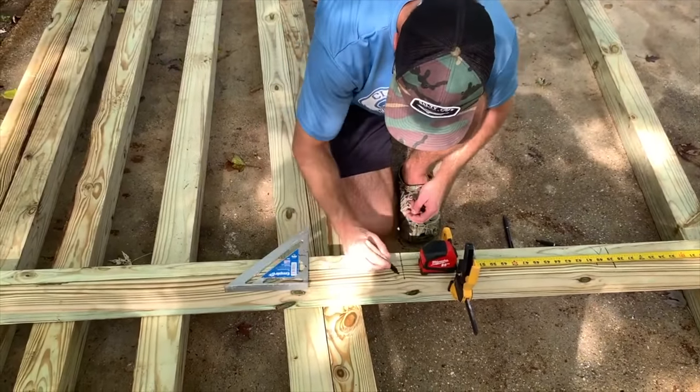And there was one segment right here where I wasn't able to get the 12 inch depth that I needed per code. So I installed some concrete, and this is gonna prevent anyone from digging this area, accidentally damaging the electrical cable. Lastly, I planted some grass seed over the soil that I used to backfill the conduit routing area.